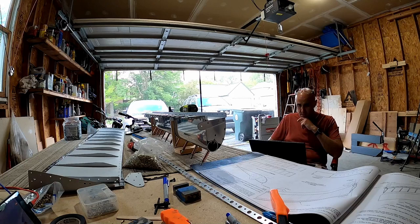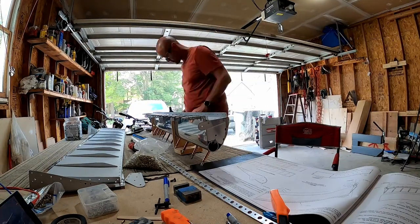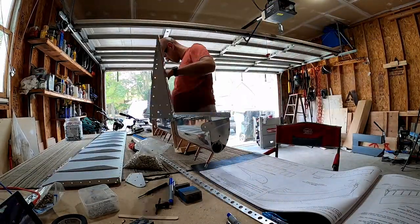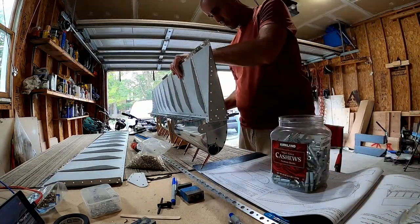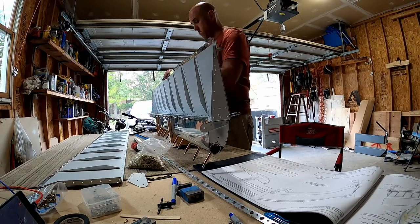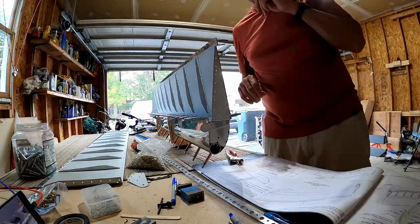I don't see my winding wires on here, which is interesting. I think one of the things that starts to set the twist in the aileron is when the spar is riveted into the nose ribs. I got it pretty good before I put the rivets in there, and then it's also going to start to twist a little bit as you put the top skin on.